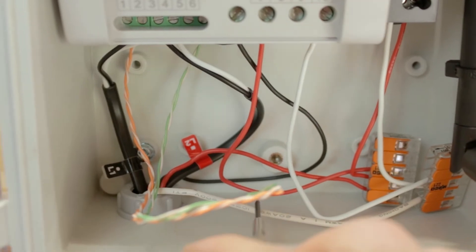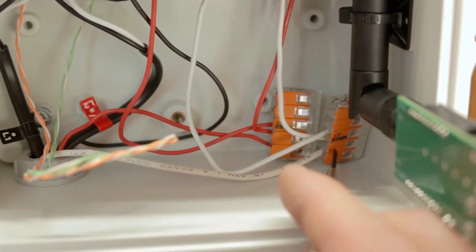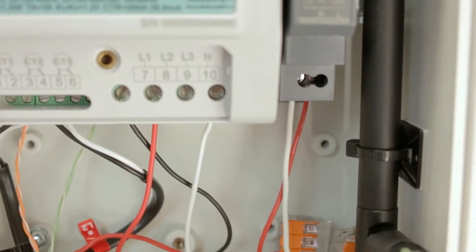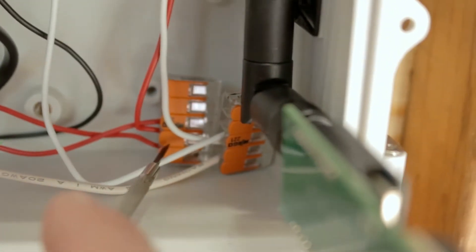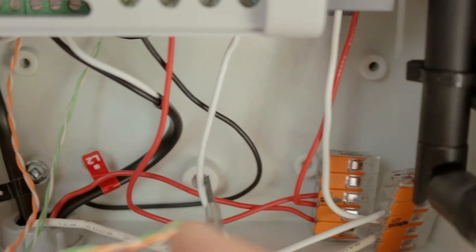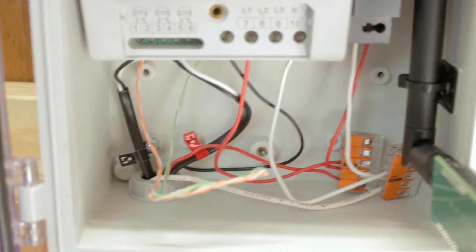Let me take you on a quick tour of how we have all of this wired up. This wire right here is coming from our panel, going down into the bottom lever nut terminal, with the second one going up to our power supply. This is our neutral, and the third line right here is coming over and up to port 10, which is our neutral on our Omnimeter. For our live side power supply, that line is coming from our panel into the bottom of the lever nut, with the second terminal coming up to the live side on our power supply. The third line over here goes up to port 8 on our Omnimeter. That is how we have the lever nuts worked in — nice and neat, no wire nuts.